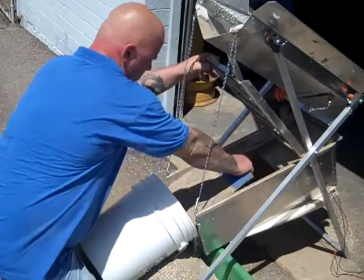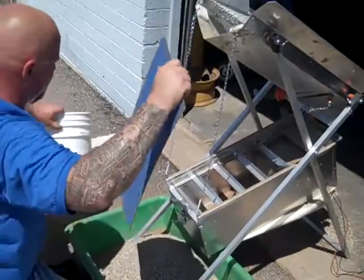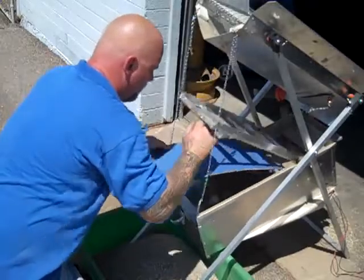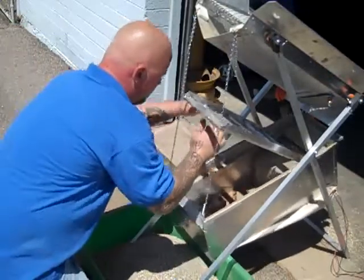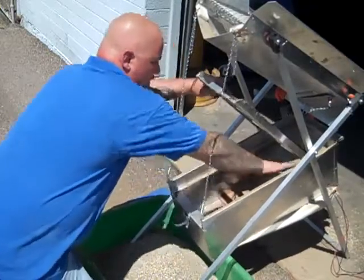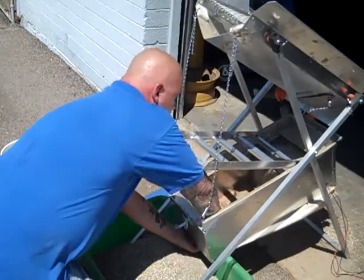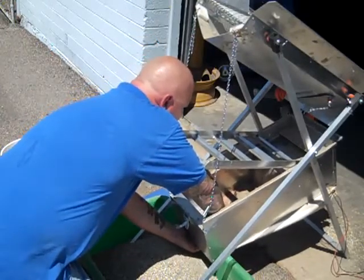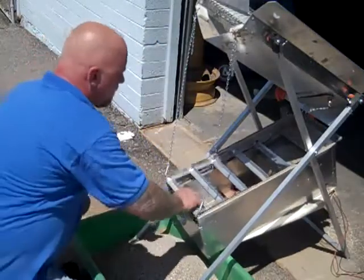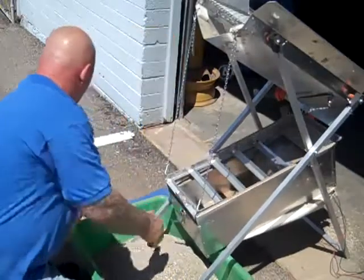Slide your tray down into the bucket or into your gold pan. Bring it up. Any gold would have been on that cloth. He just dumped it down in there. Now pull your little blue red cup out of there. And if there's any gold that got down inside it, which you can suck some very fine gold through that riffle cloth, there's a little red plastic plug in there that Tom's going to pop up. Take that, dump it in your concentrate. And now you have seen how to run the Promaster puffer style dry washer.